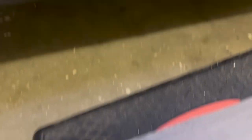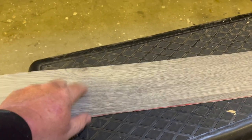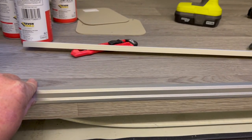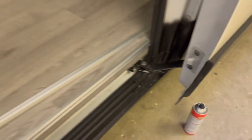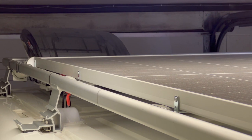I've just finished the little door trim. I cut a piece from some leftover flooring to go around the edge, so the depth of the floor is glued to the edge and that trim goes across the top - just so I'm not kicking and damaging the flooring. A nice little edging strip all the way over there, and I just need to do the back step as well.